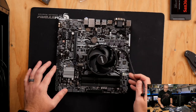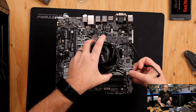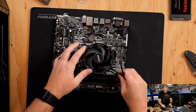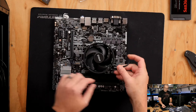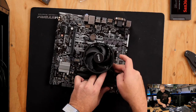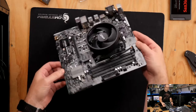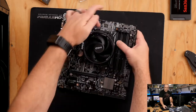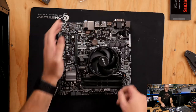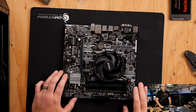Now we have the plug for the fan — it needs to plug in so the fan will spin and have power. They're usually pretty distinctly labeled; this one says CPU fan right here. Plug that in. Then we'll tuck the little wire up under there. Taking care of cable management right off the bat is a good way to do it — I just wedged it in so it'll stay in place and not look bad or come loose.